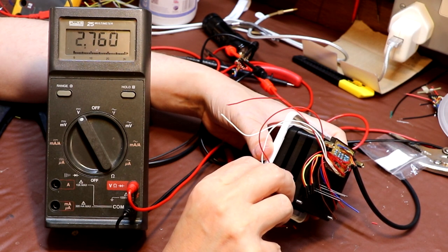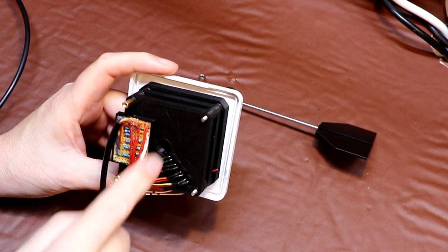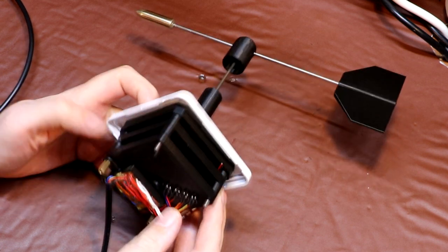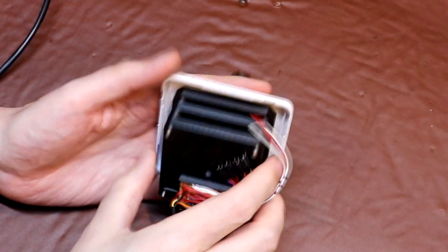That looks like it's working okay. Well, as you can see, I've gone ahead and connected all our photo transistors here, and I've also tested them, so I know that they all work. So all I have to do now is install the infrared emitting diodes, and you can see I've got the wires just looped out here. So let's do that now.